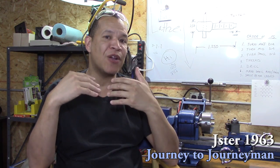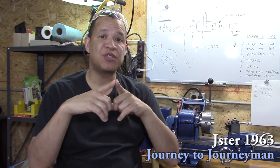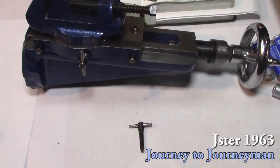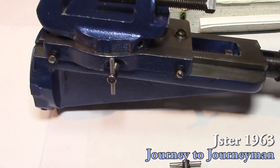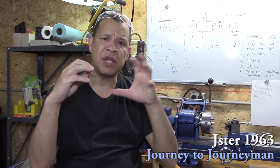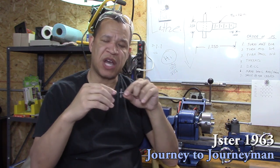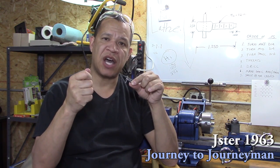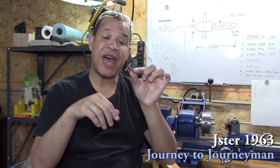On this episode, I'm going to make a piece. I'm going to climb what I call the Mount Everest of hobby machining, especially as a novice — I'm going to do single-point threading, and it's not because I'm trying to; I just don't have a die that will fit the thing. The piece I'm going to make is a small T-screw. I learned on the last episode that if I can lock that cross slide down, it really makes the milling attachment work better. So I took the locking screw out of the milling attachment itself, since I wasn't moving much in the vertical axis but was doing stuff in the horizontal axis. I took their little locking screw out, put it in the cross slide, and would lock it each time. I thought, why don't I make one of those for the cross slide, just like the one they have on the vertical slide on the mill?